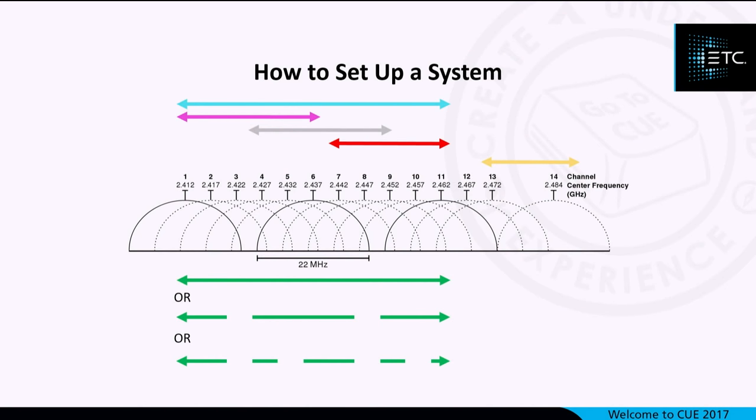So going back to channel one, this is an adaptive frequency hopping mode for the Color Source Relay. It does the same 1 through 11 as the full spectrum, but it's listening. It's paying attention to where it's getting interference, and as it progresses over time, it stops hopping to the places where it notices interference or other broadcasting. That's great in that it's avoiding interference, which means potentially lost packets here and there, which get rebroadcast. It's not like it drops out; 44 hertz is still 44 times a second. So these gaps are not enormous, and it's giving you the most ideal coverage possible, except when it starts getting really choppy.